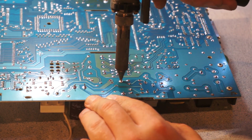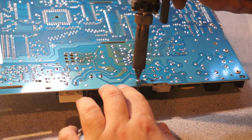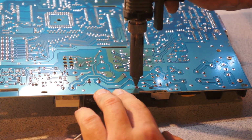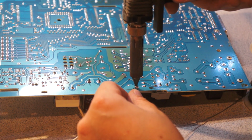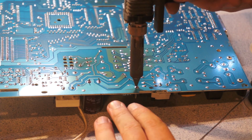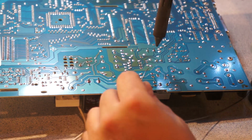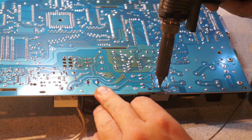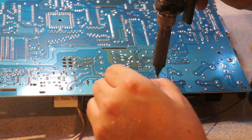Alright, it's now in manual focus, so it shouldn't go out of focus as easily. You can just see, got a big copper plate. Strangely enough, adding some solder tends to actually help melt solder, because it allows a better thermal interface between the soldering iron tip, or the desoldering gun tip, and the actual solder you're trying to melt. This is not really a good demonstration for this because I don't have the right tip.